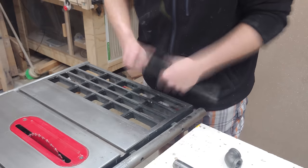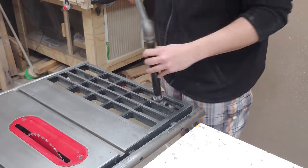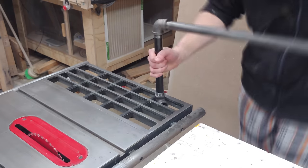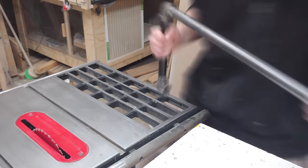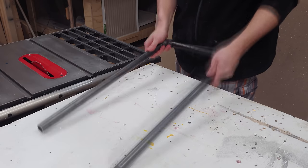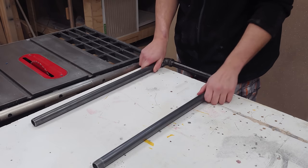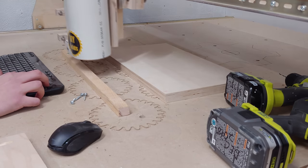The next step is going to be to drill the through holes through the 3 pieces of plywood in the exact same location. In order to get the measurement I need, I need to attach the 10 inch nipple and the two elbows to each other permanently, so this distance will never change. With both 24 inch pipes temporarily installed, I can bang them against the table to even out both ends to make sure it sits flat. Now we take a measurement and we can start drilling the holes for the through holes for the 3 pieces of plywood.